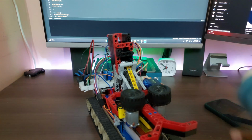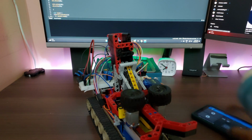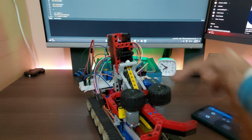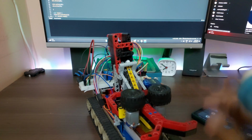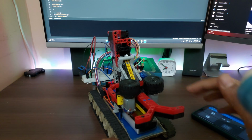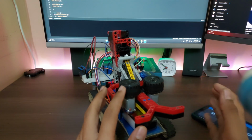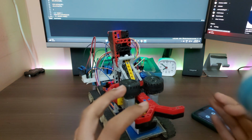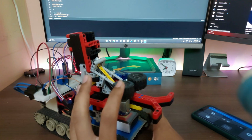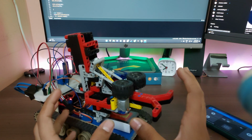So when the servo horn moves, like if I show you, as you can see, when I click this button, the servo horn moves and it releases this bullet, or what is more appropriately named a projectile. It falls down using the natural slope, so it uses gravity to fall down and into these two motors. These are just two flywheels, so these spin at super high rpm. When the button is pressed, they then fling the projectile off, and this is there for stability. I'm not exactly going to show how you can recreate this. This is very much experimental, but anyways, you get the point.